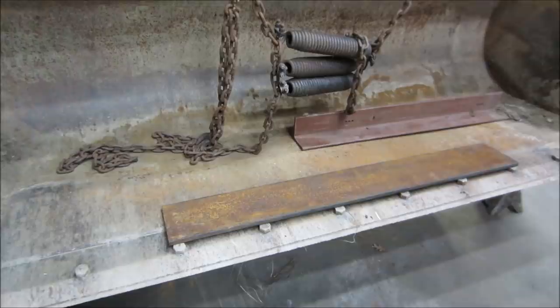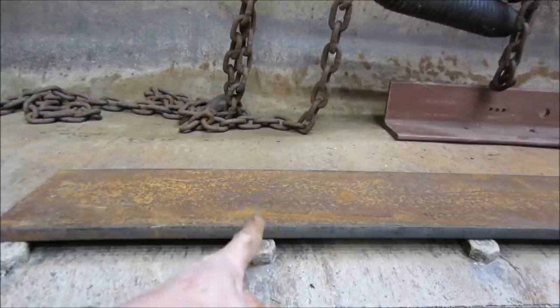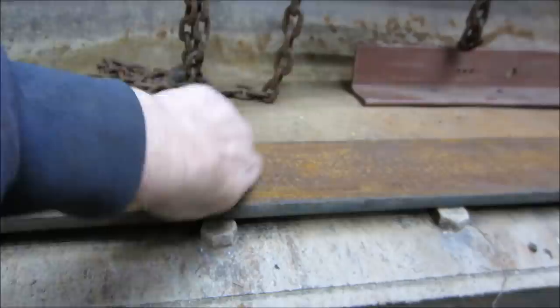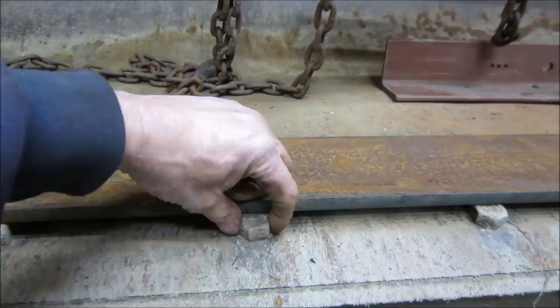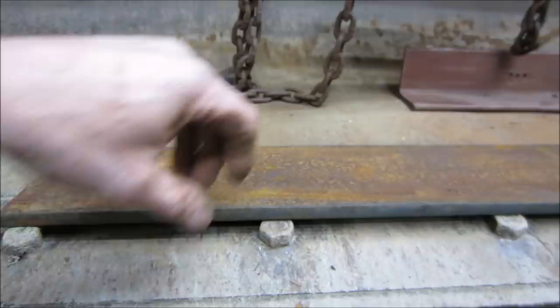And then wherever we line up, which is gonna be, you know, what was it, this bolt? Yeah. We'll put a piece of angle, that angle. We'll put one this way, and we'll put one this way. So it'll be an L, and then a reverse L. We'll leave a gap in between there for still having access to the bolt. Because the pin is pretty wide. The pin's like 5 inches wide. So we could have some slop in it. Actually, it's probably a good thing instead of having it snugged right up on it. Give it a little bit of room for stuff to kind of move and not get broken.